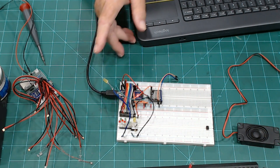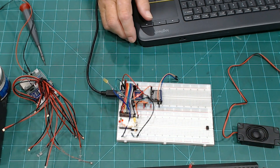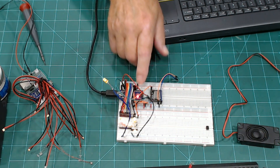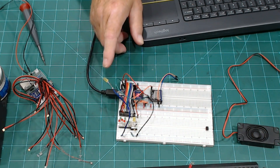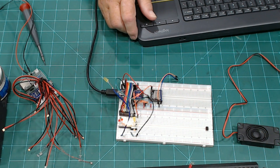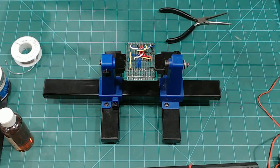A4 and A5 are designated for I2C, so I'm going to leave those open just in case I want to use that for something else later. You can see on here I have all the LEDs lit up right now. I added one on pin 13, and I have these two over here which were on 0 and 1 now on pins A2 and A3. Let me reset this so you can see it going in sequence. You still get the little flash on pin 13, but you can see them all starting up in sequence. I'm satisfied with that - we can transfer this over to the circuit board.